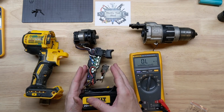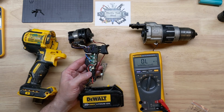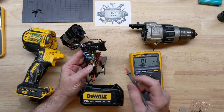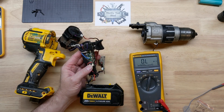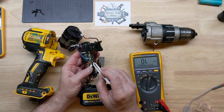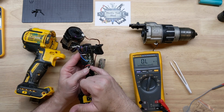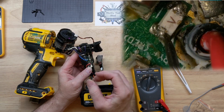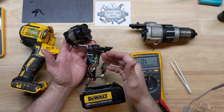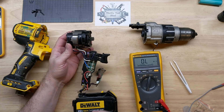This drill did run a while with the fuse soldered in, and there's no actual solder issue here. I used what I had — the original fuse that checked good. But when those fuses got picked off during potting removal, they tombstoned. They were probably fine until I flicked them — almost loose. I may have peeled off part of the end, so the fuse isn't making connection between the solder end and the ceramic fuse body. I'll get this removed off camera and get the board under the microscope for a closer look.